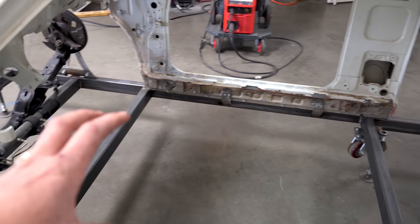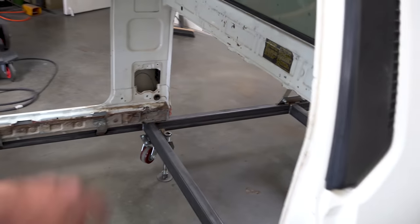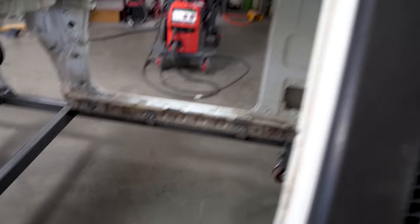Now, if you're not sure or you want to be extra safe, you should have at a bare minimum three tubes that run through here: one from A pillar to A pillar across, one from B pillar to B pillar across, and one from B pillar to A pillar diagonally stretching to the opposing side. That's at bare minimum if you're only cutting up something that has A and B pillars. If you have A, B, C, and even D pillars, you'll want to do the exact same thing and triangulate them all the way across.